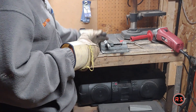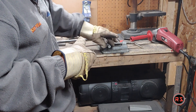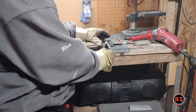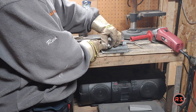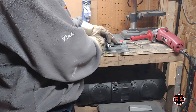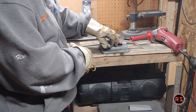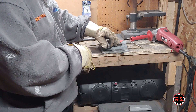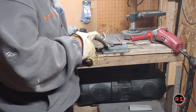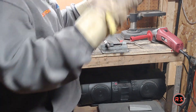In this case the bolt doesn't fit in my drill — it's three-quarter inch and my drill chuck opens only half an inch wide. So what I did: I put some oil in the thread, and the bolt is loose enough that when I put my grinder on the side it makes the bolt turn. If you push too hard it will stop and you'll create a flat spot, but if you just rub the head of the bolt with the grinder it spins in the opposite direction of the blade, making a cleaner cut.